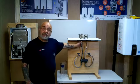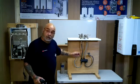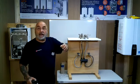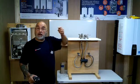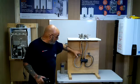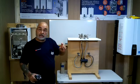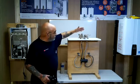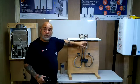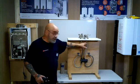Now, on the faucets that have the built-in speedies, like the Deltas, they have 3/8 built-in braided speedies or the black anti-burst. And if you look inside, there's a red and a blue ferrule in there. What you're going to need to do is you're going to need to still get half by 3/8 speedies, but you're going to need to get compression unions. Here, with a 4-inch center set basin faucet, whether it be 2-handle or a single lever, a lot of the times they have half-inch IPS.